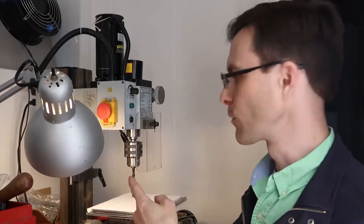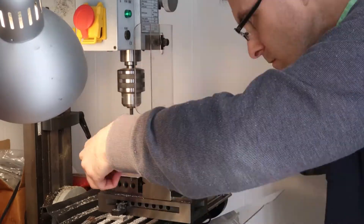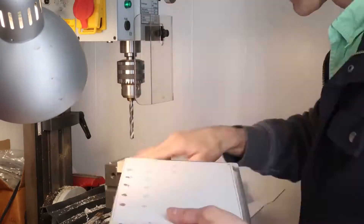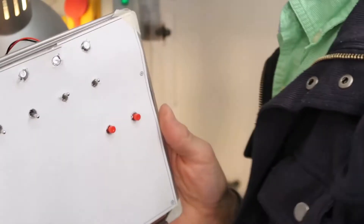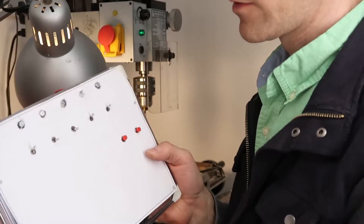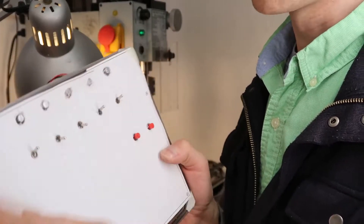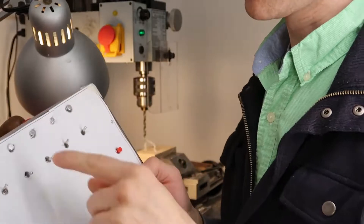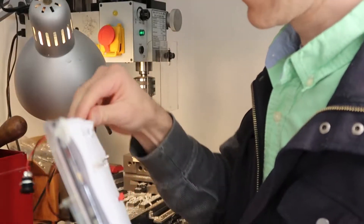You might not have a milling machine like this to do the work on, but that's alright. You can just use this like a drill press and slide around to find the holes. You can do it just as easily with a hand drill - it's really not a high precision job here. I have to admit that was a lot harder than I thought it was going to be. I'm used to making machining from drawings, using dial indicators to get down to a thousandth of an inch. Holding this by hand and using a paper template that can slide and move is really difficult. I definitely recommend using double-sided tape in some critical areas to hold the paper down, because it does want to slide and move, and that's only going to give you lots of errors.